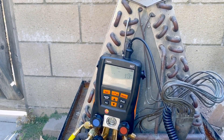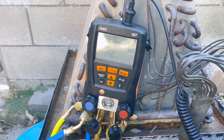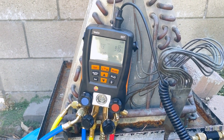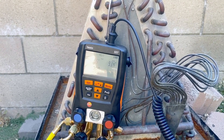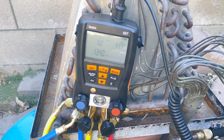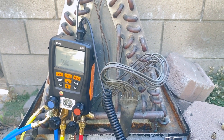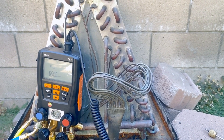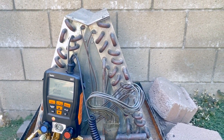Switch to vacuum mode by hitting the mode button twice — past pressure test mode into vacuum mode. Once it goes below 10,000 microns, it starts showing a micron reading. You'd normally pull vacuum until it hits a minimum of 500 microns; personally I like to go down to about 300-400. Then you isolate it by closing off the valve, separating the pump from the evap coil to check microns. Turns out this evaporator coil has a big leak so we couldn't pull a full vacuum, but that's how you use this gauge. Thanks for watching — like, subscribe, hit the bell, and follow us on Instagram and Facebook.